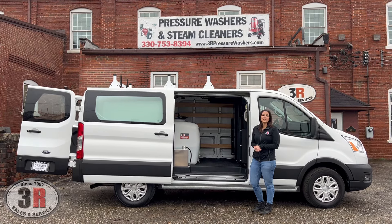The aluminum fuel tank is also nice because it's got a fuel gauge on it so you can always tell how full it is. The 200 gallon tank — your incoming water goes into there. We've got a filter on top to keep any debris that comes from your customers' houses, since there's all kinds of stuff in their spigots that'll go right into your tank. That filter keeps it cleaned out and will also prevent your float valve from getting clogged.